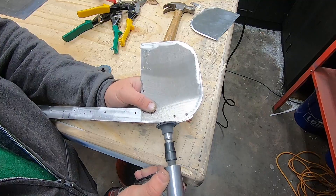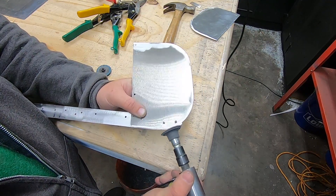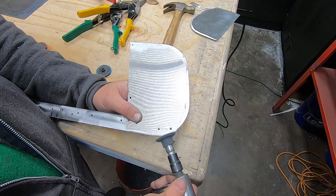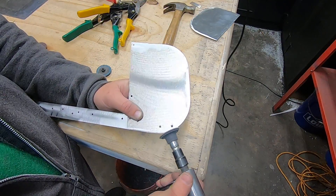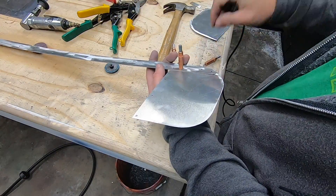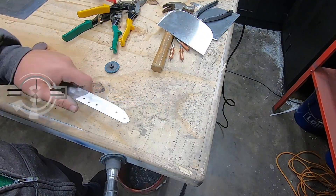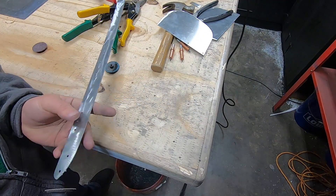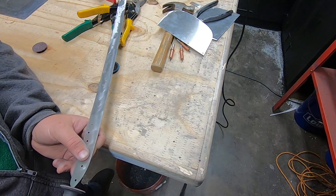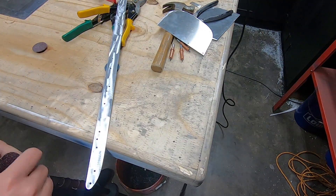I've linked the products in the description, so I won't go into detail on that part, but I do want to do a brief overview of the process that I'm doing to prep for primer. In my experience, simply abrading the surface isn't sufficient for anything to stick well. I like to use an acid etch followed by an alodine conversion coating. This leaves a good surface that primer does stick well to. Don't take any of this as a how-to instructional video — I'm just showing you how I decided to go about it.